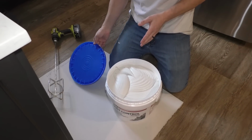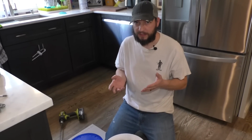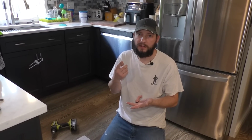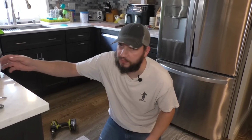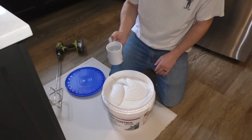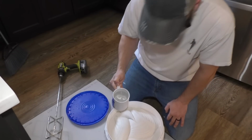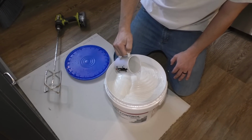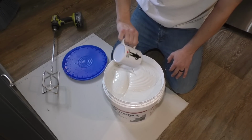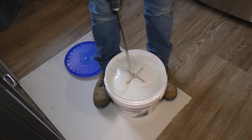You can also use a mix, a powder that's like an easy sand would work. They have 20, they have 5, 90. They chemically cure just like the Durabond, but it's totally up to you. I'm going to use this, but what I do to make it go on the wall smoother is I add a cup of water, about this much. Product placement. Add that there. And then I'll mix it up. And be careful here. Don't want this flying all over the kitchen.